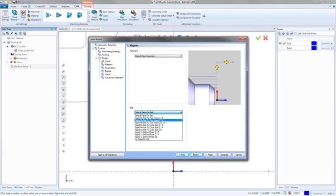Now, what you're looking at really is these letters on the end. When it says X-Z, it means it's moving the X, then it moves the Z. And the second one there, it's moving the Z, then it's moving the X. And the little one there that's got no dash in between them, that's doing an angle out. So that one you got to be careful with.